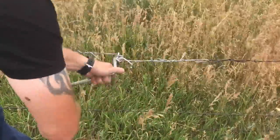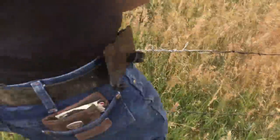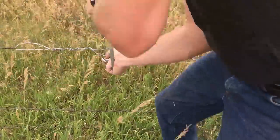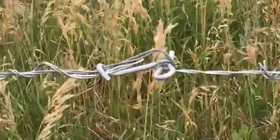These tighteners were invented in Lee County, Texas by David Franklin Ells, but his friends called him Jake. The concept is pretty simple. It's a clip that fits over a loose piece of wire. The handle is used to turn the clip, winding it around the wire, and then it locks itself by clipping over the wire. These clips have worked great for us on the ranch.